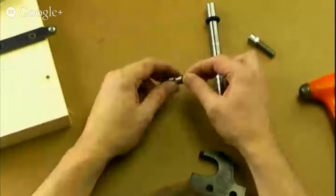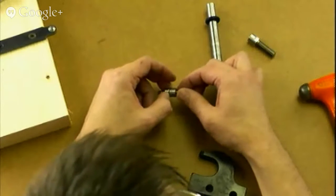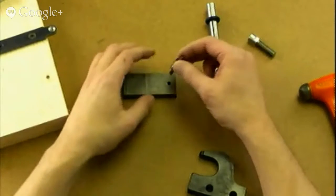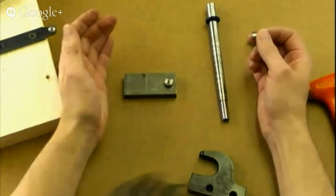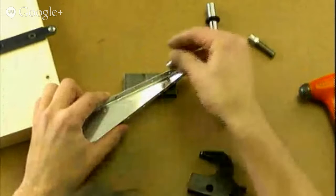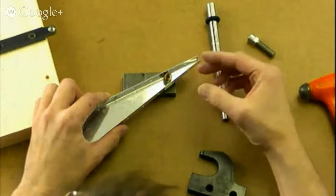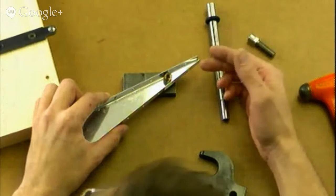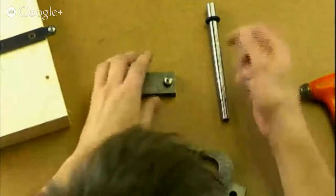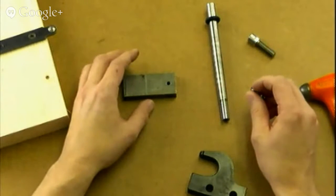The C-frame design works very well for the impact type tool. If you're building an RV where you're going to do 15,000 skin dimples, a C-frame is the only way to do it. If you're doing a repair, you can go back to the old school way with just a die held in something, put the part over it, and hand hold it or use the rivet gun. I like to use the most controlled method to get the most accurate and predictable results — the rivet gun is probably the least controlled method.